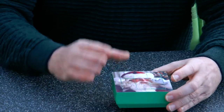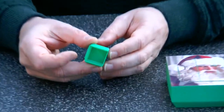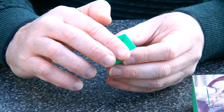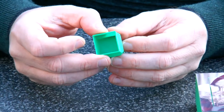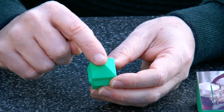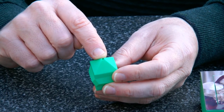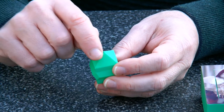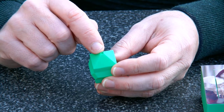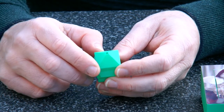In order to get to this stage, as I explained before in a video, I liked the vase mode. So these parts are extremely hollow and they have a roof. I experimented with several types of roofs. The first type I tried was a point roof, and everything goes fine until you get to the very point — because the nozzle keeps going around and around and there is not enough time for the material to solidify before it makes the next round. So a point roof was not possible.